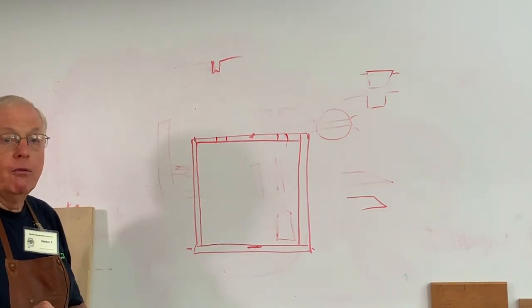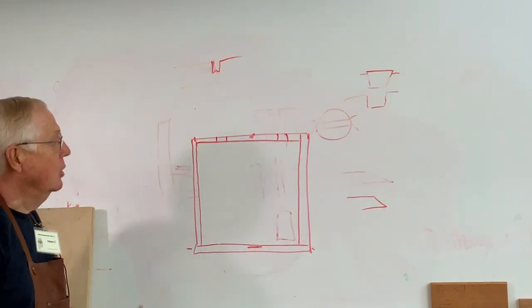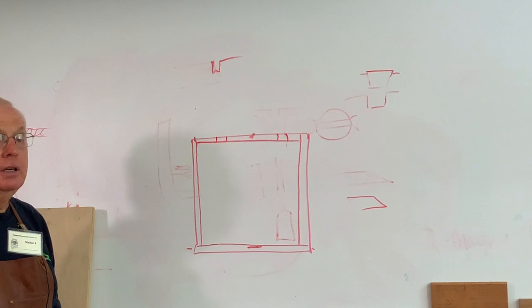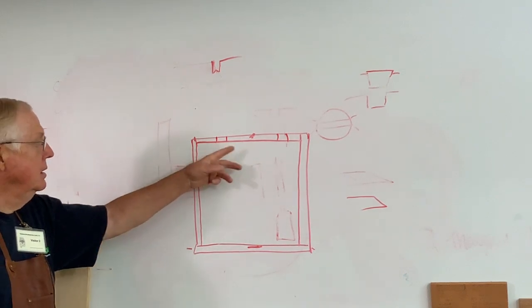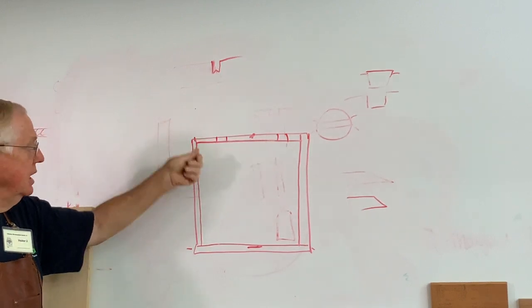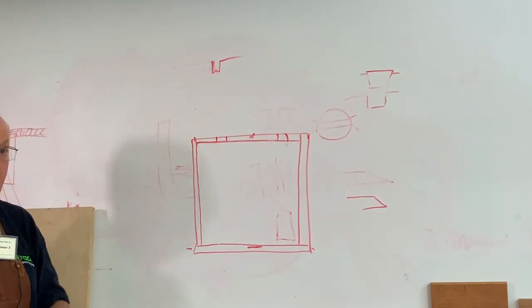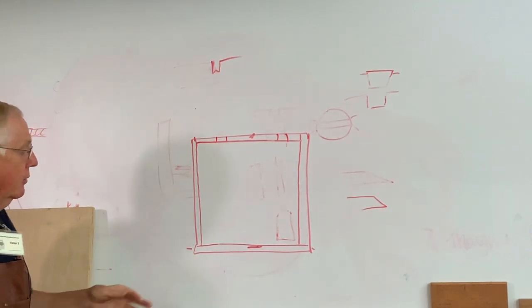They did not allow for shrinkage and expansion. So every old sugar chest you see, if you want to make sure it's old, there are three things to look for. First thing is, the hinges have got to have been replaced because there were no stop hinges and they didn't put a string in there. People were moving away from the wall and open the lid up and the thing would fall over and bust the hinges off. The other thing you look for is the lock.